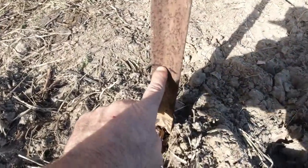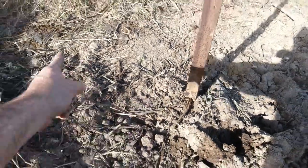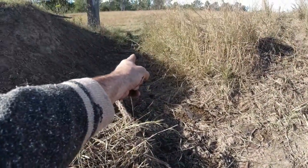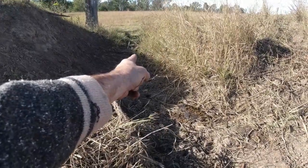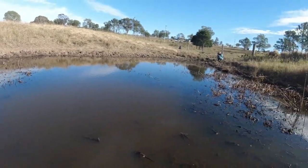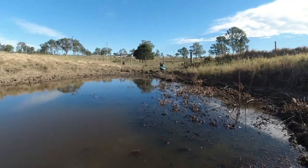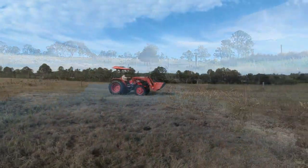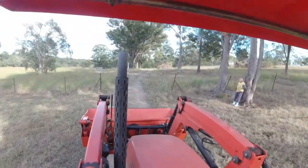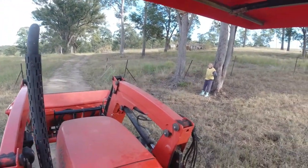As you can see, the level is right there. So it looks like we're going to need anywhere between eight to ten inches at the other end, and maybe six inches right up close to here. Now we've taken the water level and made the nikko marks — it looks like we're going to end up with six inches of clay at this end and a foot of clay at the other end to fill it up to the level required. Where Nicole is standing with her feet, that's where the dam level will end up.